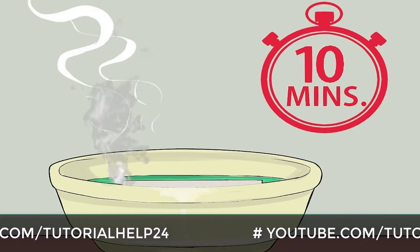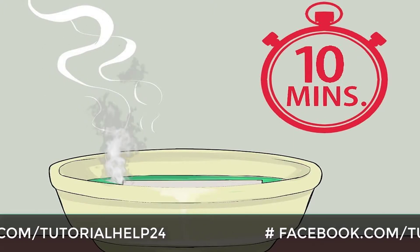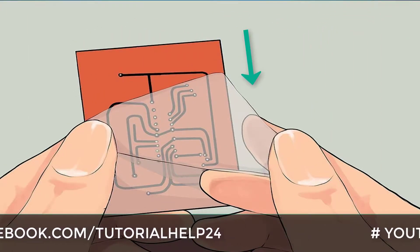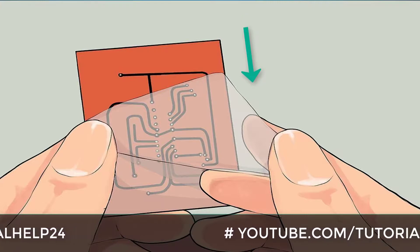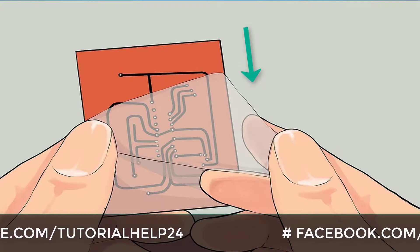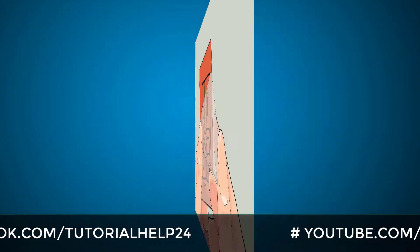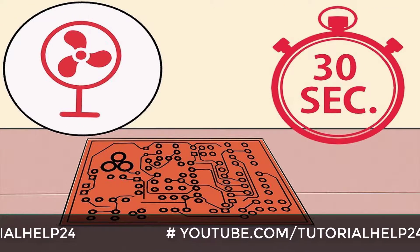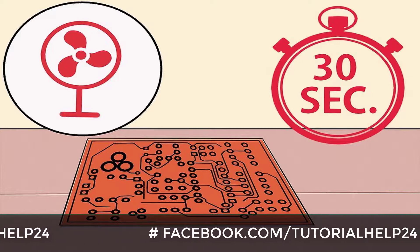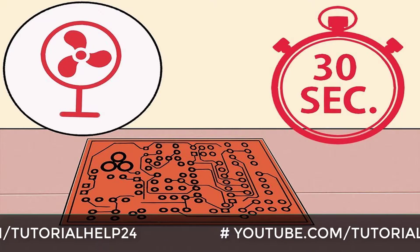Start the water flow and hold the circuit board below it. An alternative approach is to immerse the board and paper in hot water for a few minutes, up to 10 minutes. Slowly start taking off the paper and soon all of the paper should come off. If certain areas seem particularly difficult to peel off, try soaking a bit more. If everything went well, you will have a copper board with your PCB pads and signal lines traced out in black toner. Dry the board by softly wiping with a napkin; this should not take more than 30 seconds and should not be vigorous or else the ink on the circuit might come off.